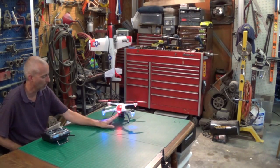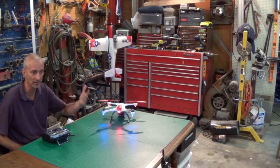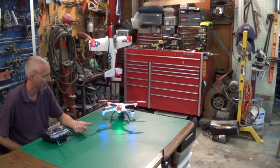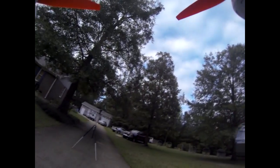If this light is on and flashing, then what that tells you is that you don't have a correct GPS location. It's armed, but it doesn't have the GPS location. So as long as it's on and solid, where you turn it on is where that return to home is. So it's recording. And then we'll put it away, arm it up in smart mode, walk 16 feet away, and then that'll become the home position.